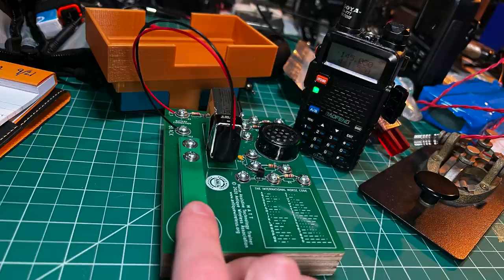Human voice is complex, and we want to pipe that through, modulate it, and get it out as RF. So why would anyone want to key up and use Morse code on an FM radio? There's not a whole lot of reasons. It's kind of esoteric — people won't necessarily understand what you're doing, but you're not truly encrypted either. Remember, once you key this down, even if you have a little buzzer or beeper putting Morse code through FM — literally a code oscillator sending dits and dahs — it's still being expressed at 10 to 15 kilohertz. So there are no efficiency gains, and you'll still have difficulty getting the propagation you want going longer distance with FM 2-meter or 70-centimeter radios.